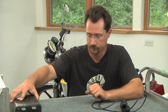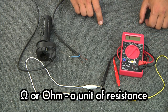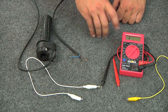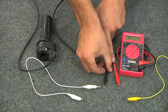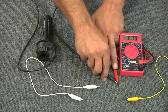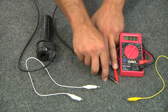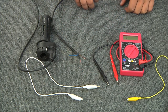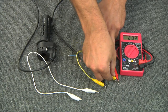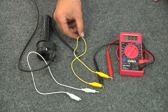We've got our multimeter that is set to read ohms. It'll read up to twenty thousand ohms right now between these two probes. Most meters vary a little bit. In the case of this one, it'll give you a one when it's a broken circuit and the two probes aren't touching. But if I connect them together you'll see that changes to either zero or pretty darn close to it. So on this meter, one means an open circuit and when you touch the probes, zero means closed circuit. Instead of doing the probes directly, I could also use some jumpers to make it a little easier. If I connect this probe to this probe, it's reading zero ohms — no resistance, just a short circuit — those two are directly connected by this yellow jumper.